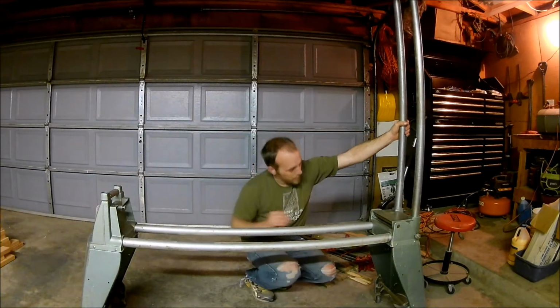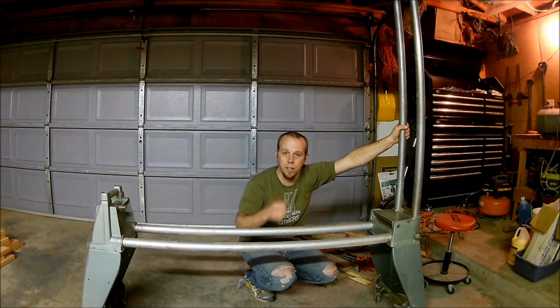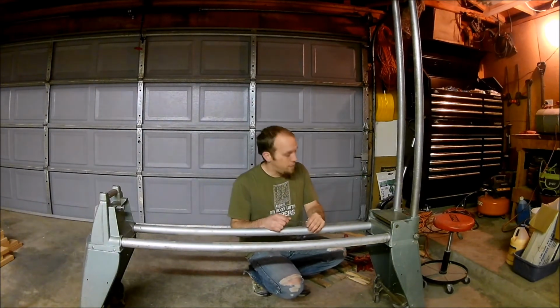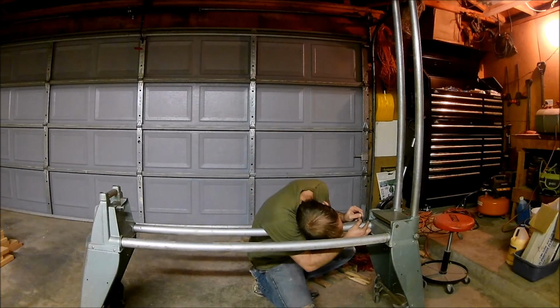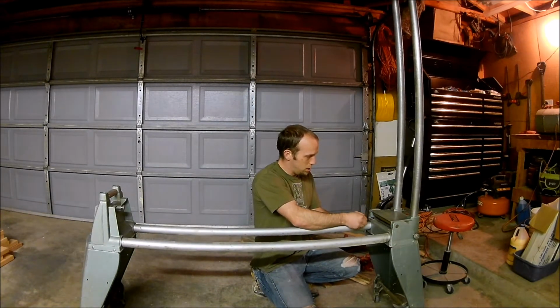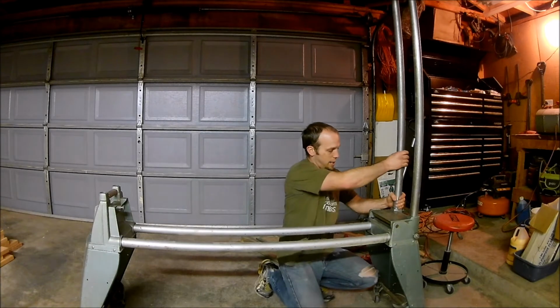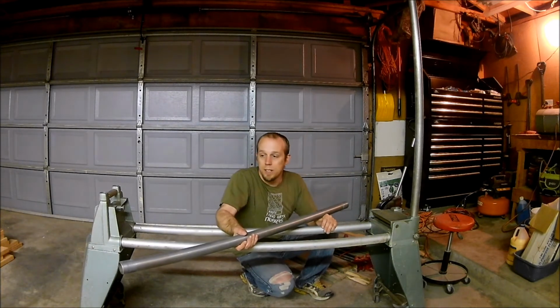So if you lift these pipes back up, inside of this end piece down here, there are set screws in the bottom. So you'll have to use the long Allen wrench that usually comes with your Shopsmith and get in there to loosen those. I'm only going to do one for now so that you can see how it works, and then you can usually do it from there. And from there, just leave the Allen stock in there for now. All you have to do is a little bit of turning. You may have to do some persuading on it depending on how old it is and how long it's been since it's been torn apart.